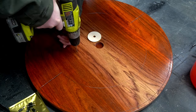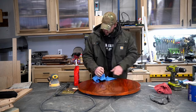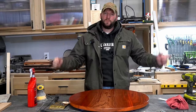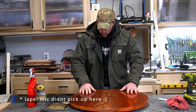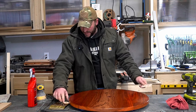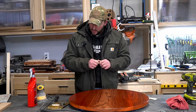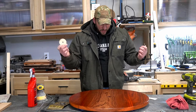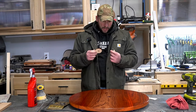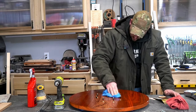I applied a bit of finish into the newly drilled hole using a paint brush, then pre-drilled all the holes for the bumpers. Before installing the bumpers, I applied a few coats of express wax with a microfiber cloth, which I had seen recommended in the forums for slicking these boards up ready to play. I bought these pegs from Brown Castle Games and they really outdid themselves — they look great. It came with a protective circle so you don't accidentally mar up your board when the screwdriver or drill inevitably slips. I installed the bumpers per the instructions and then wiped down the board one last time before testing.